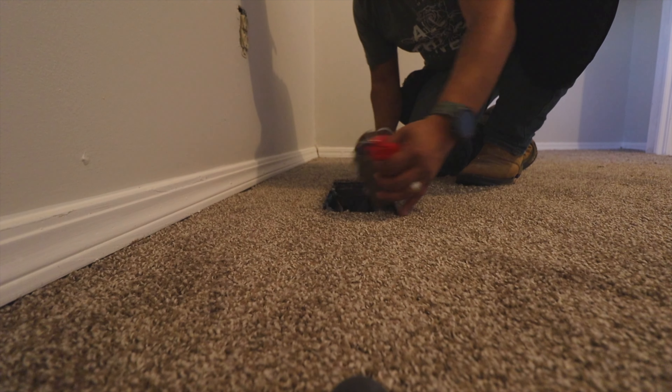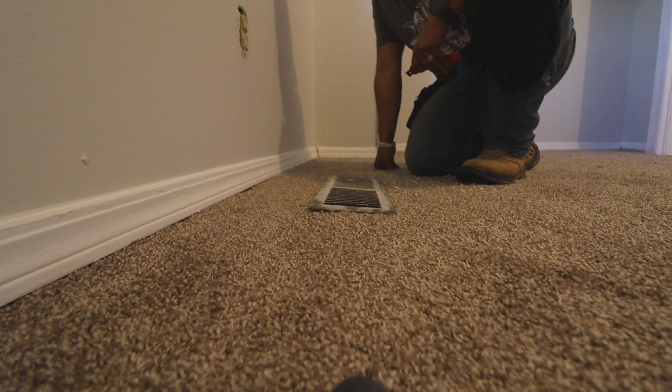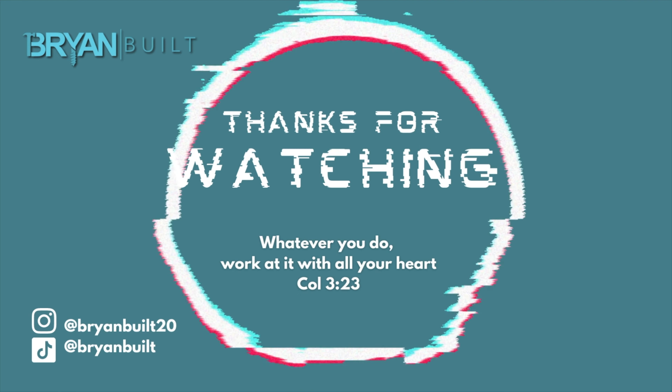That's it! There you have it — this is the room with no seams at all. If you have a room that's less than 12 feet wide, the length doesn't matter, and you have a closet right there — you can do it without any seams. This was one piece of carpet all the way through. Looks good, it is done — tucked everything in, cut out the vent, my arm hurts a little. The other room we did with the seam, and that one's done as well. See you next time.